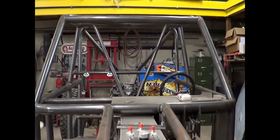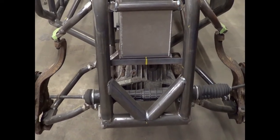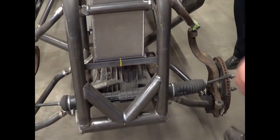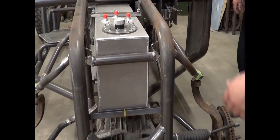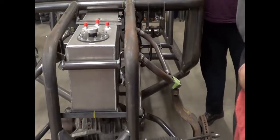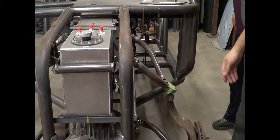So basically, I have an 08 Chevy Malibu rack and pinion here, and they're set up for electric steering. So what's run into them is the power. You have to have power running into it. There's no plumbing on it, so you don't need a power steering pump. But it also still has a high ratio of turning, unlike a manual rack that you got to turn six or so times. So you can turn this one a little and you're going to flip the wheels pretty good. Yeah, I think it's a three turn total. So one and a half is all the way to the right and one and a half is all the way to the left, if I remember correctly.